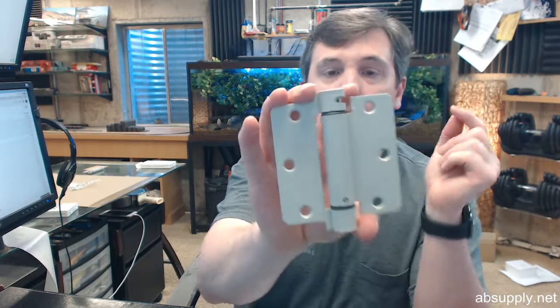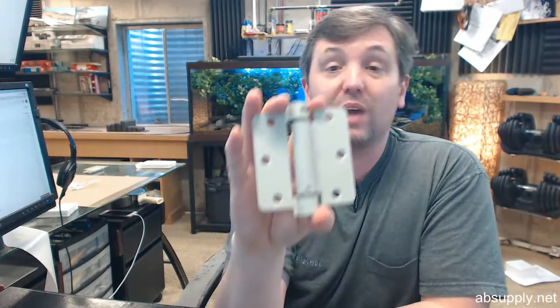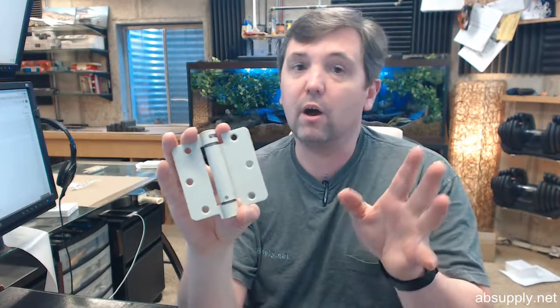ANSI templated screw hole pattern. If you have a 3.5 inch hinge and your screw holes look like that, half moon, some people call it, or they're like this, that's called template pattern. There's a link below this video to a document called Template, where you can review the precise location of the screw holes. And by all means, if you're unsure if your hinge matches those locations, just refer to the template and compare that against your existing hinge.